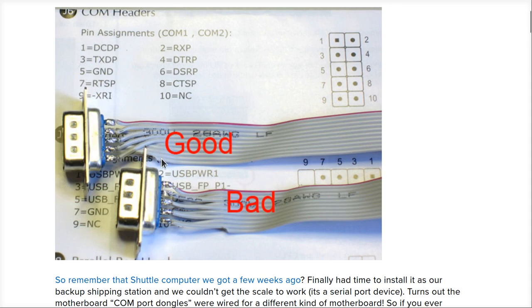Now look what happens with the other four pins down here, the four wires, right? They go on the bottom row. These are numbered in a round robin order on this connector: 1, 2, 3, 4, 5 across the top, and then 6, 7, 8, 9 on the bottom going back up like this, all right? And whoever invented the connector can number the pins however they want.